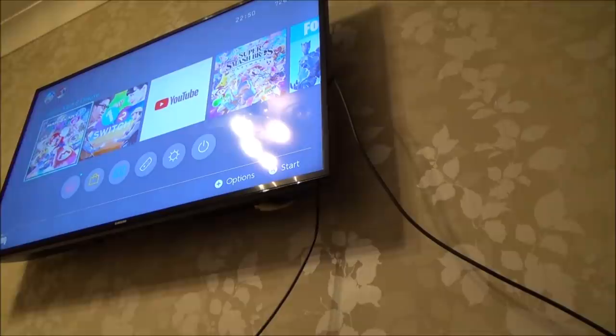So yeah, I'm going to keep working on this and just keep trying to find out what it is with that display, because I'm happy that that connector is fully connected. I've gone across both lots of pins, the top and bottom, many times, and I can't see any of that wobbling or anything. But I'm thinking it must be something to do with that connector. That's the most obvious choice. But what do I do? Take it off and put it on again? Not sure. What I might do is try and get some very sharp needle with some crocodile clips and actually see if each of the pads are connecting to the pins. I think that's what I might try and do. But we're definitely making some sort of progress at long last.